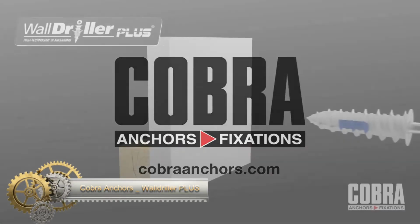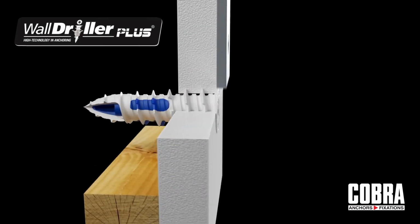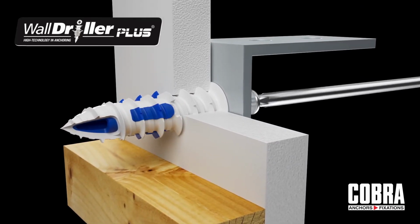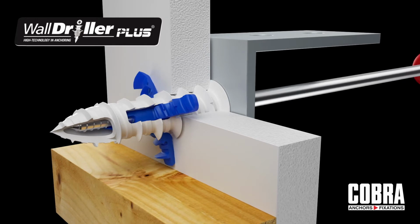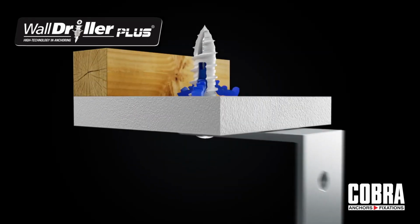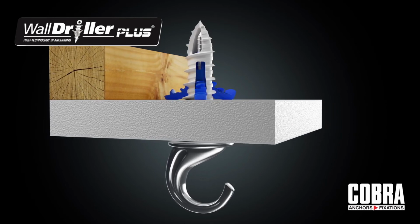The Cobra Walldriller Plus stands out as a high-performance drywall anchor, offering exceptional strength and durability with its bi-material construction. Featuring a reinforced nylon body and an acetal expander, its 3 expandable legs provide up to 2 times the holding power compared to standard anchors. With a fine centered point and sharp profile thread, it facilitates easy installation while ensuring a secure grip behind the drywall. Available in various sizes, this anchor requires no pre-drilling, making it versatile for hanging shelves, mirrors, and heavy items in both standard and humid environments.